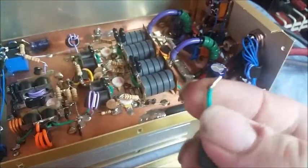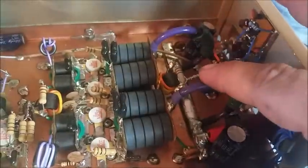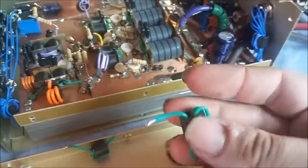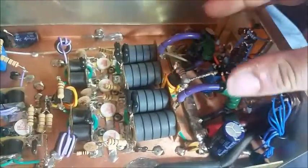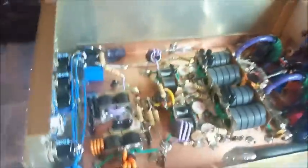So anyway, man, we went from powering each of the 2 transistors with this, 18 or 16 gauge, to stiff 8 gauge. I mean, you can tell which one's going to power. Of course, this right here is definitely enough for it. To me, it just makes me feel better, and I think the amp runs a lot cooler when you heavy it up like that, and especially feed each one individually.